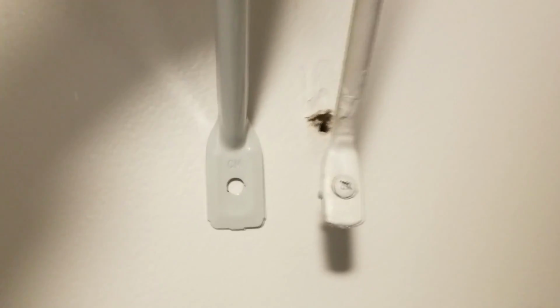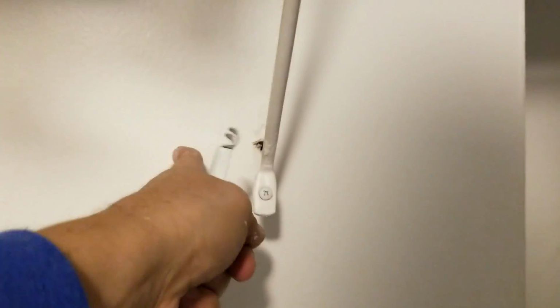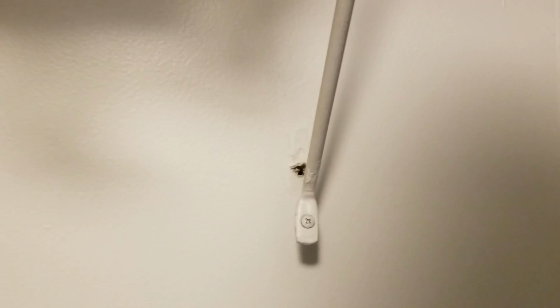And then on top of that, they used this old strut here, and I can't stand these old types, with the plastic thing there. And what's really bad is, see right here how small that landing pad is, when you're supposed to be using one like this. I like to think of the old Apollo mission, where the landing pad, when they land on the moon, poof. So it's just better to have a bigger piece like this, because something like that could tear right through the drywall.